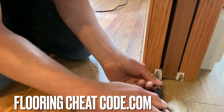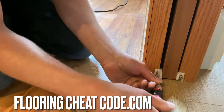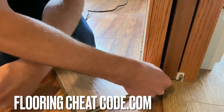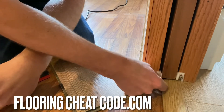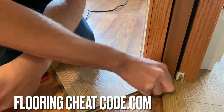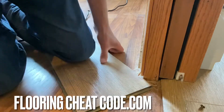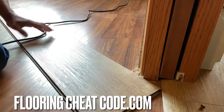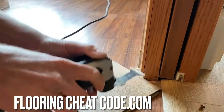We're going to take our screwdriver and remove the little door stopper on this pocket door here. We actually broke the doorway because with laminate, it's going to expand and contract. So you want the option to have it move from room to room, and you're going to add a reducer in the doorway to let it flow as the weather gives it the option to expand and contract. Make sure you do that with your laminates — break your doorways.